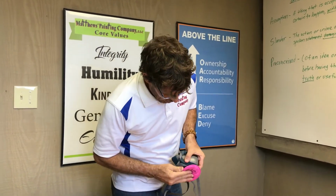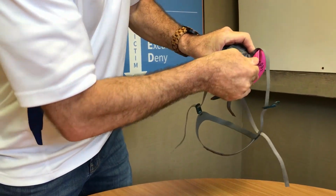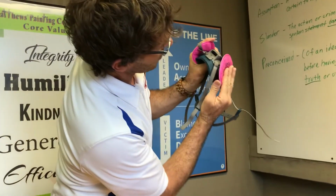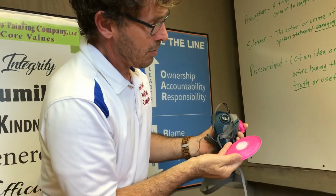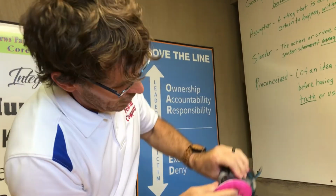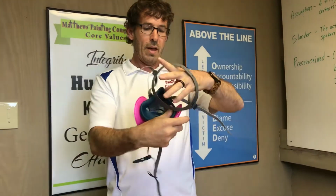So it's the same thing. These we grab, we go until it slides in nice and flat there, and then we turn clockwise, not quite a quarter turn. I'll do the same with this one. I'll find my slot, or I could take some time and actually look. There we go. Once that fits flush in there, I give it a little turn until it stops. And now that's set up for scraping lead homes, lead dust. Also can be used for drywall dust, but it's a little bit overkill. There's those N95 respirators we used on the last video that people will use for drywall dust, but you certainly could. Any type of dust that's in the air.